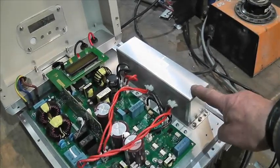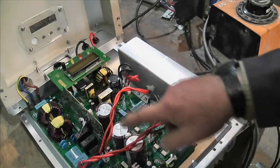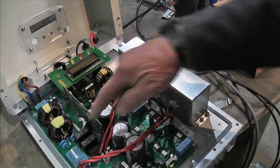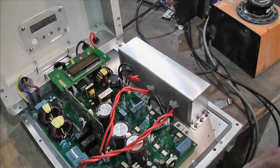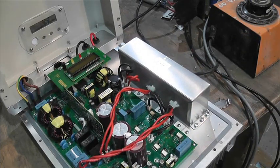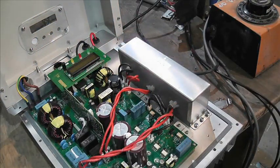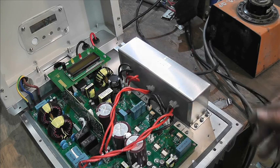That's a huge capacitor block. There's a relay under there, and two relays there. This sort of layout reminds me of an Ever Solar — little relays there and a fuse down there. It's very much like an Ever Solar, and they were alright. It's the business of overpowering them and disconnecting at high generation points that damages the relay contacts.